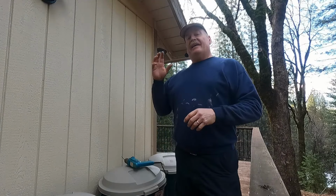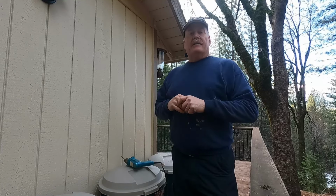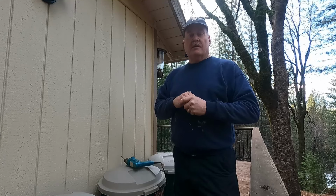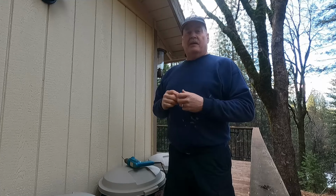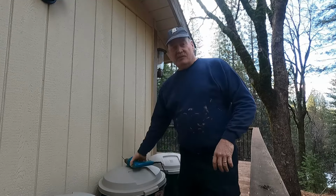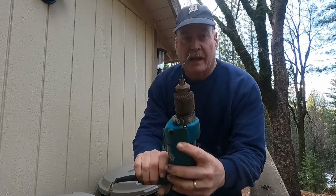So it is the next day, and I had to stop what I was doing last night for two reasons. One reason was it was getting dark, and the second reason, I went to drill the holes for that generator interlock, and this is a prime example of why you should film everything when you are making videos. I thought, okay, I'm not going to bore you with drilling holes in this cover plate for the electrical panel. Well, I used the drill bit that was supplied by the company that makes the interlocking device. And when I got it, it looked kind of funny to begin with. It was dirty, like maybe it had been used or something. And I'm not sure what's going on with this drill bit, but it wasn't drilling very well. And so I pushed harder on the drill, pushed harder down on the drill bit, and this is what happened.